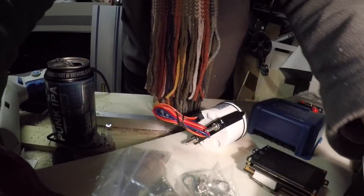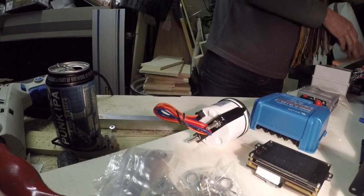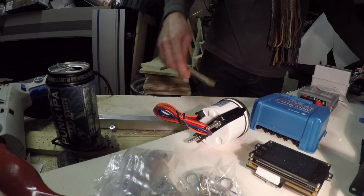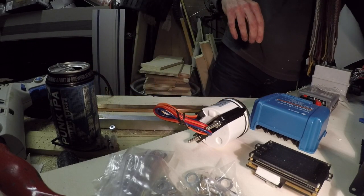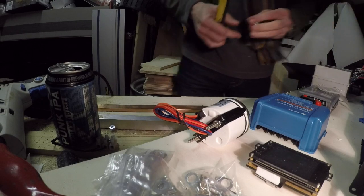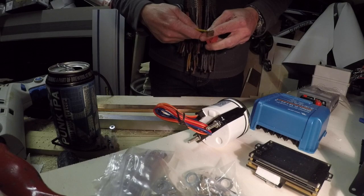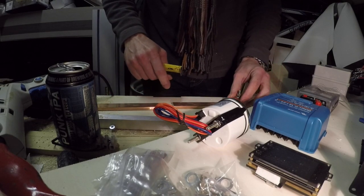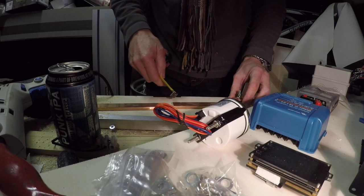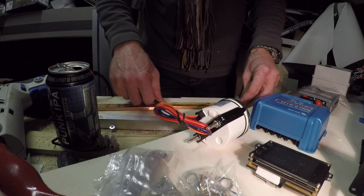So I'm just figuring out the bus bars. I've got this length of copper bar which I've already cut down to fit the board. We've got these feet which are M4s, so there's two on either end, and I've got six connections in between, so it's going to be quite tight actually. 16 divided by 8 is every 2.